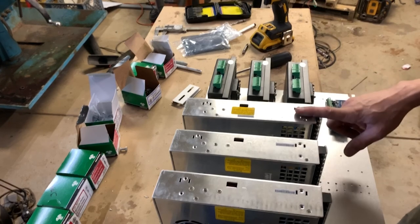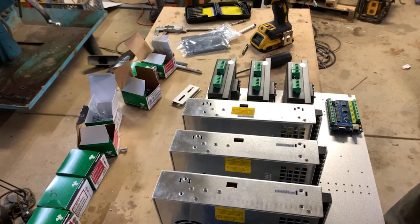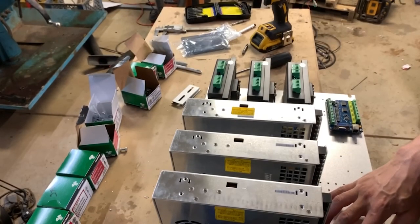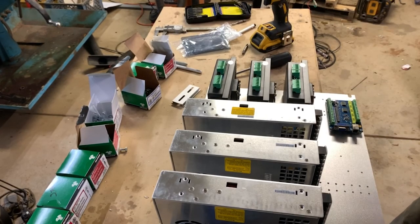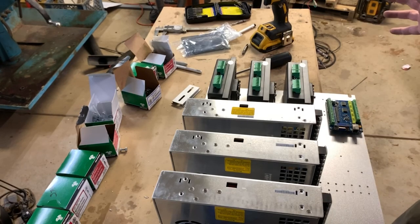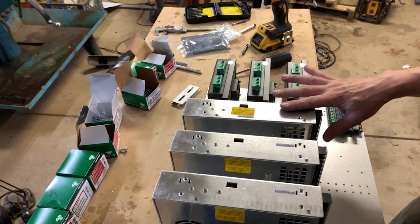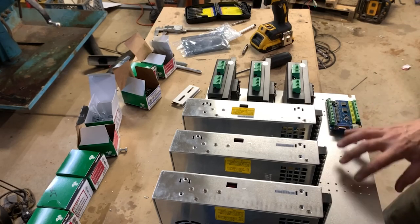Then we'll also need input. I'm gonna probably set these up for 220 volt. That way I can bring in the spindle power or the mill's power into this, have it go into a terminal block here and get the power out for everything so that you don't have to go find a place to plug the mill in separately from this. So right now, I think that's about it for mounting the bulk of the hardware into the control box here. Wiring it and getting all the pass-throughs and then putting up my terminal connectors is gonna be in the next video.